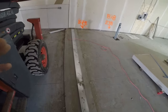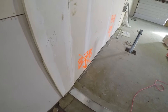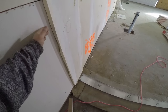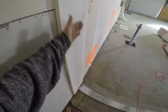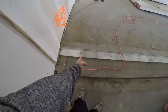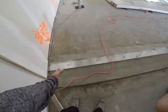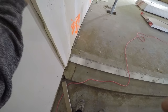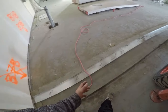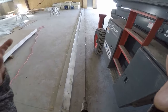Also take into consideration: if you're framing off a wall that has steel with drywall and you're doing 16-inch or two-foot centers, make sure you come out 16 and a half or 16 and five-eighths to your first center, and then go 16s or two-foot after. Come out the width of the drywall if that wall is going to have drywall, because when you go to drywall you'll be over a half inch and it won't work — you'll have to piece it in and your whole layout's blown. Any questions, ask me in the comments.